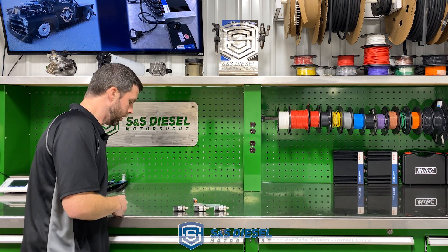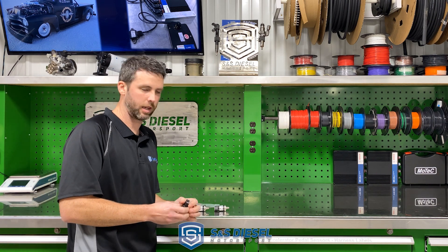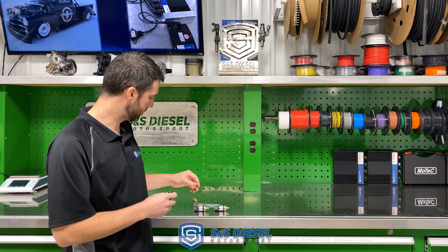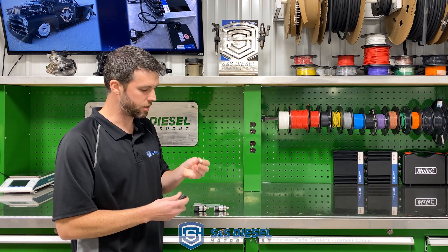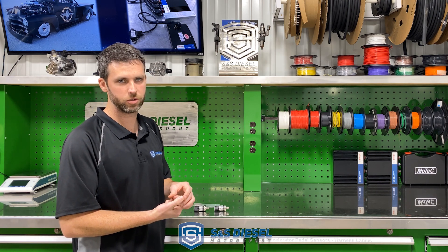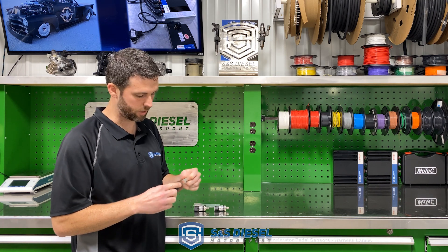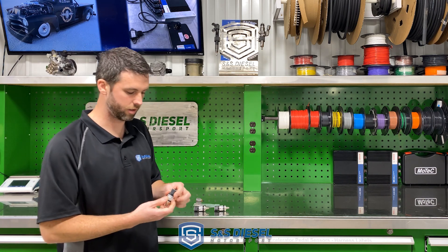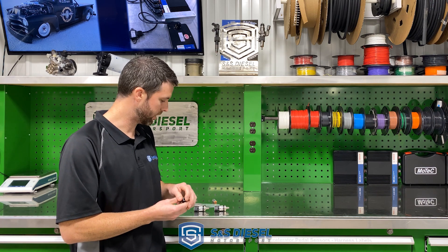So we came up with a different design of pressure sensor, which uses a connector we use widely throughout our standalone electronic systems — a 3-pin Deutsch style connector. These connectors are really, really good. We hardly ever have issues with them, assuming your crimps are good. It's a nice, positive snap connection and they work really well. So instead of that other connector, these pressure sensors have this much, much better 3-pin rectangular Deutsch connector.